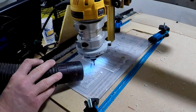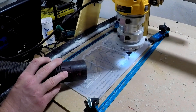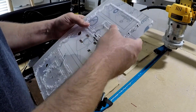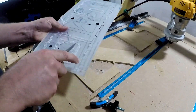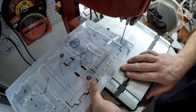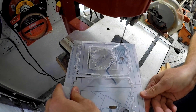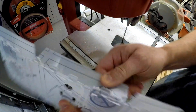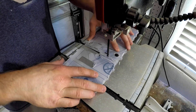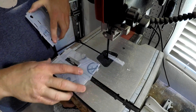I'm cutting out some of the smaller pieces out of eighth-inch polycarbonate - that's where the electronics sit, as well as the head that I'll put on in another video. As it turns out, I didn't cut quite far enough, so I had to do quite a bit of deburring work, first with my Leatherman and then I took it to the saw. It just goes to show that you really should use holding tabs and just cut all the way through, otherwise the penalty is having to do quite a bit of work on your saw, Dremel tool, files, and everything else. It's quite a pain.